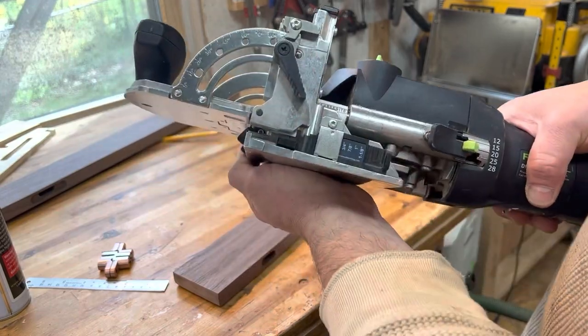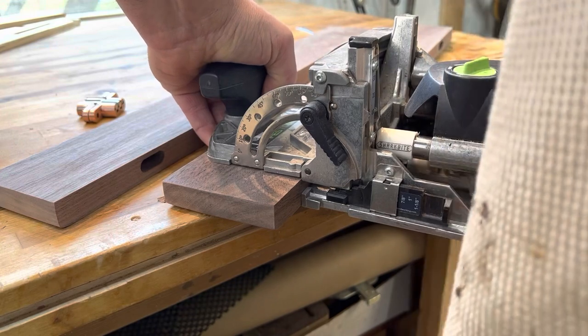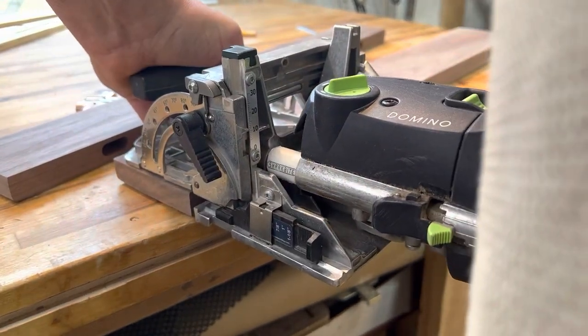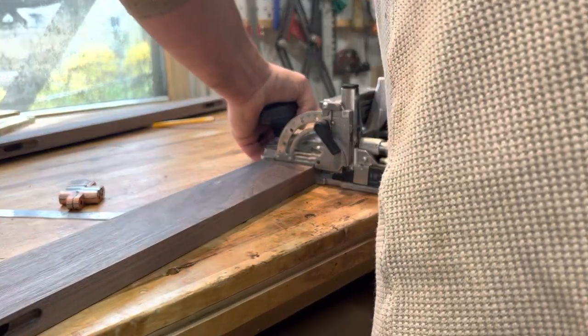In order to cut this groove I set up the top measuring piece 18 millimeters from the center part that I originally measured, and I cut each of my side wings. You can see how this gives the deeper center part and two shallow wings.